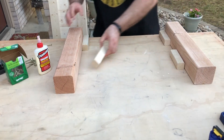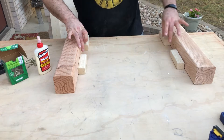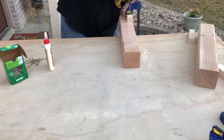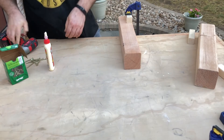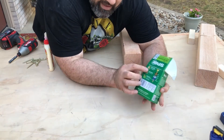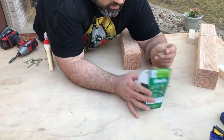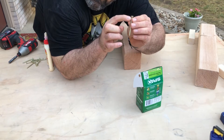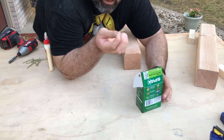We are going to put these on like that — we're going to have the 2x4 come in here, so that's how it's going to look. What's cool about these screws is they're designed to countersink for you. They have a little groove on them like teeth right here, so you really don't need a countersinking bit.